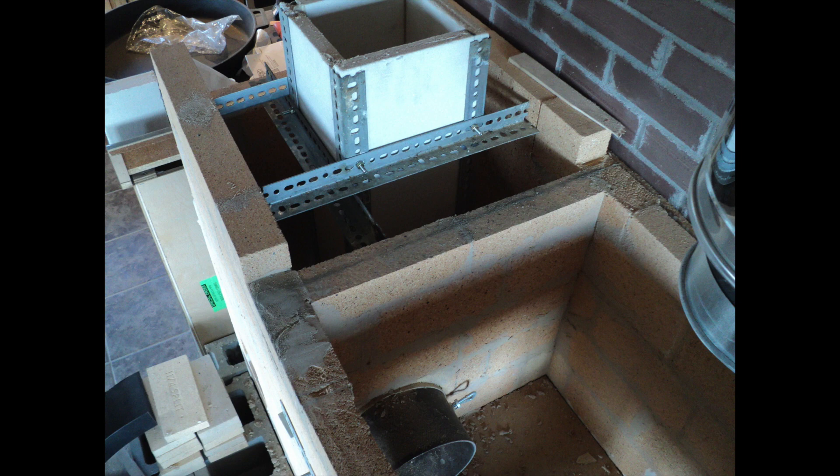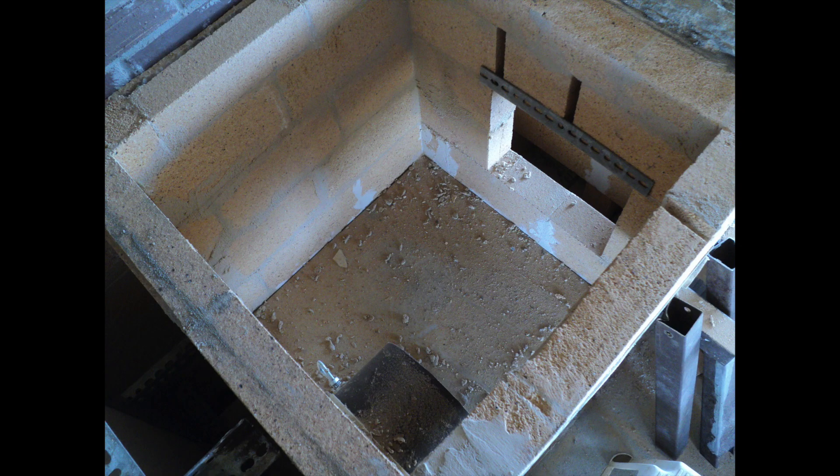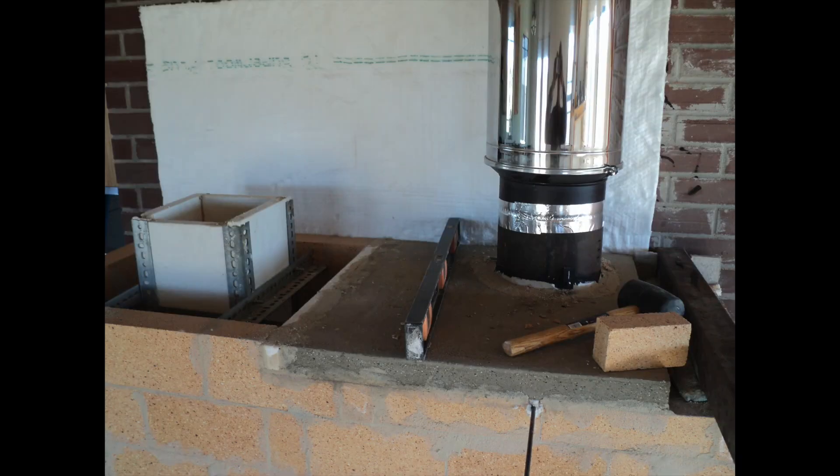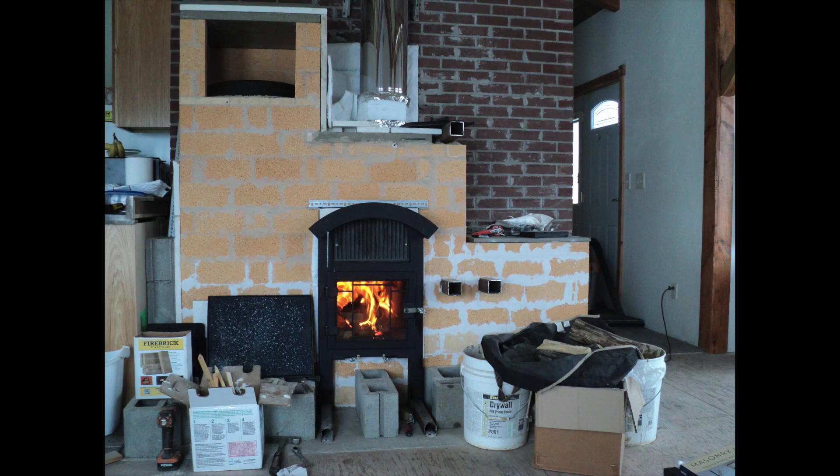Then I added the chimney bypass and reinforced the riser tube with metal angle. The chamber above the firebox was capped off with an inch and a half slab of refractory cement. The damper was added and connected to the stainless steel chimney. The bottom of the oven was formed where the riser tube would meet, then that too was capped off with a slab of refractory cement and insulation added. I then set the cast iron bottom in the oven and started a fire to see if there were any leaks. The top of the smoke channels on the right and floor of the wood storage area was just a layer of fire bricks with a big thick tile set over the top of them.